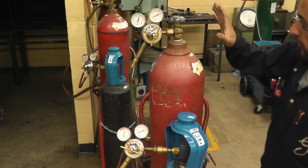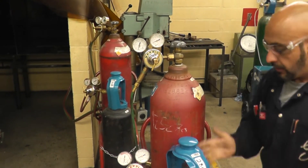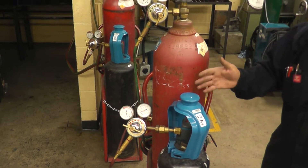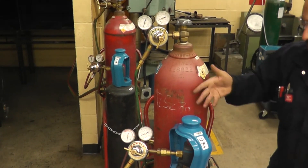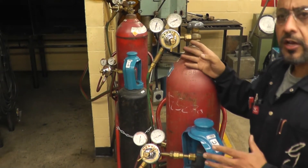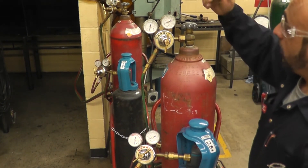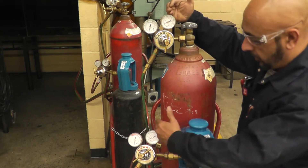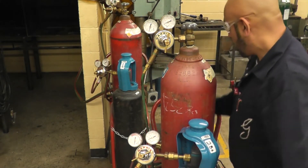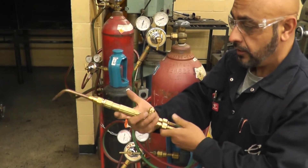I'm going to start off with the parts. We have the oxygen tank and the acetylene tank. We have the valves — this is called the tank valve on oxygen, and this is called the acetylene valve or tank valve. Most tanks are now coming out with the smart valve. We have our regulator — its function is to regulate the pressure you're working with, since tank pressure differs from working pressure. The gauges closer to the tank show the pressure inside the tank; the gauges closer to the hose show the working pressure.